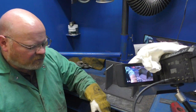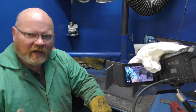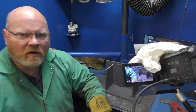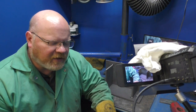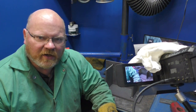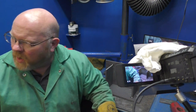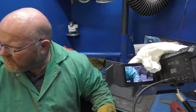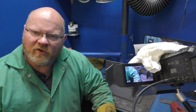The other videos in this series on welding boundaries will include non-tight and tight boundaries, showing that progression. This would be relevant for someone going to BIW — Bath Iron Works — from my school. They build Arleigh Burke class destroyers for the U.S. Navy; they're a General Dynamics company in Bath, Maine. I'm welding with flux core: 052 flux core wire, 240 inches per minute, gas-shielded dual shield wire with C25 shielding gas, and the machine is set at 23.4 to 23.5 volts.